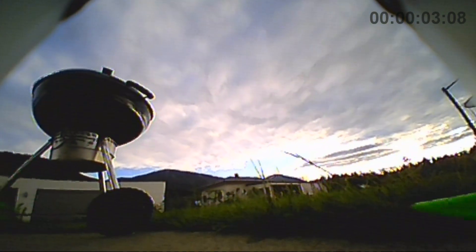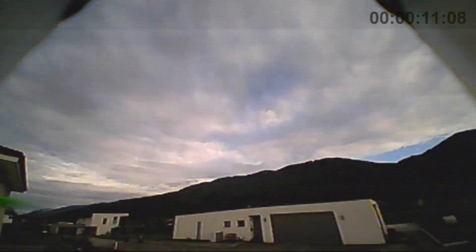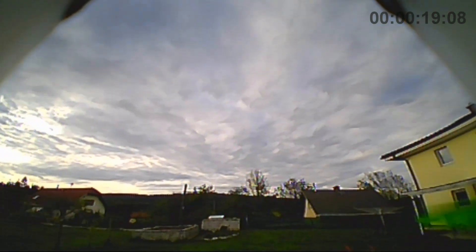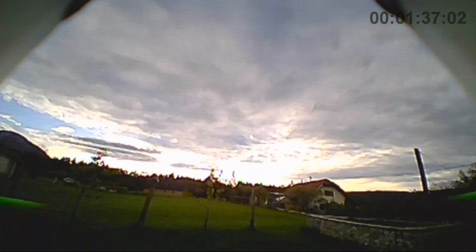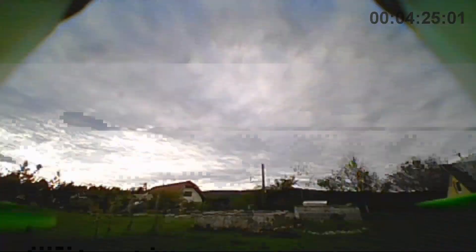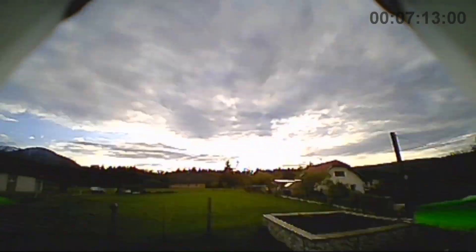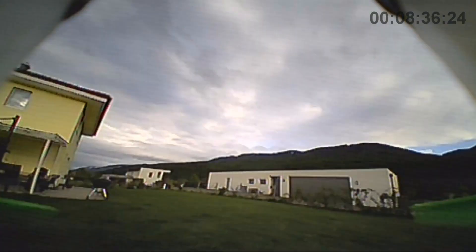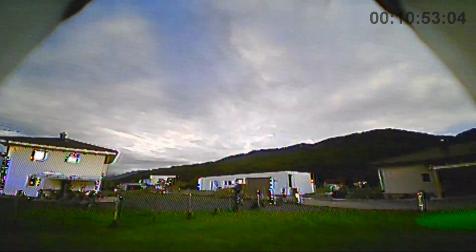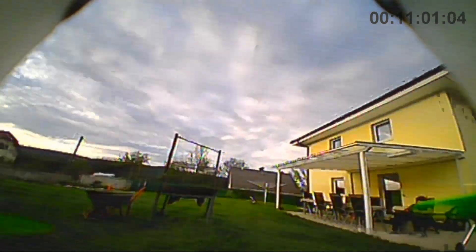Now it's time to go flying. For this flight I wanted to casually fly it around — not only hovering, really flying — in order to assess the battery run time in real life of the 850 mAh 3S LiPo which I am using. You can see a time lapse of this flight including a time counter at the upper right. More than 11 minutes of flight time on this little guy, after which I had still 10.9 volts left in the battery. Of course, these 10.9 volts were measured without any load on the battery, but I could have probably flown it for a few more minutes if I had really tried to stress the battery.